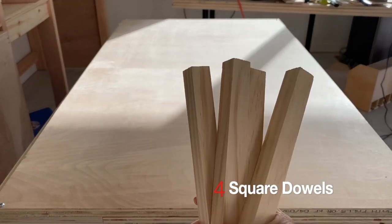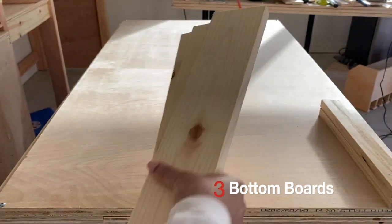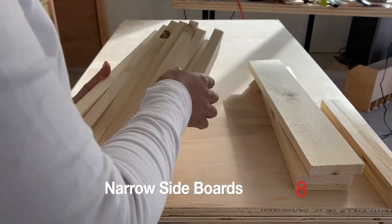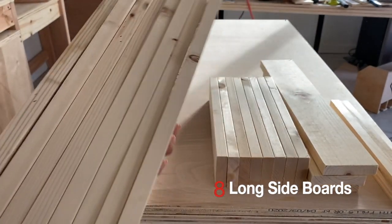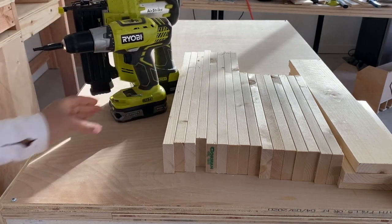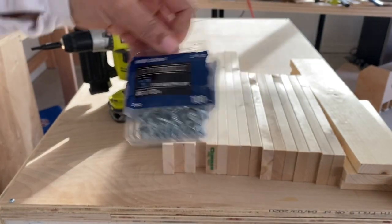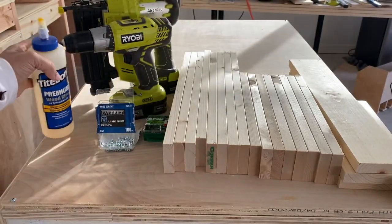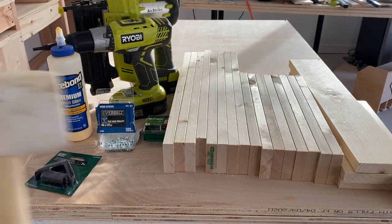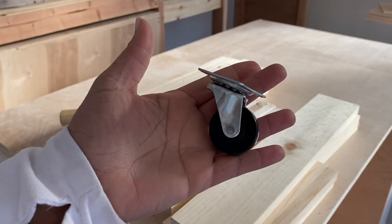Here's everything you're gonna need. 4 3/4 inch square dowels. You're gonna need 3 boards to support the bottom, 8 narrow sideboards, and 8 long sideboards. All of the dimensions are gonna be in the description box. An 18 gauge brad nailer, a drill, 1 inch screws, some 1/2 inch screws to support the wheels, and some wood glue. And these decorative corner braces just to add a little pizzazz. I also use this mallet just to knock some things into place. And don't forget the wheels.